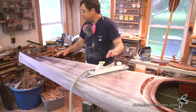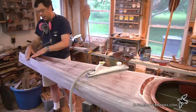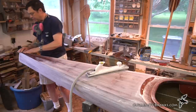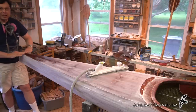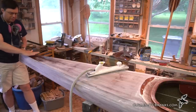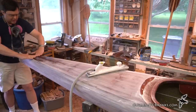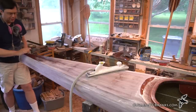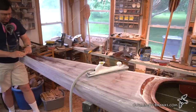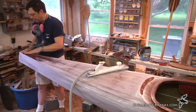As I get into the back deck here there's a similar thing going on. The angle from the top to the side is more pronounced — easier to not mess that up. But I also have a spot where the flat curve of the back deck transitions into a little V, and I like that detail. So I want to hold the block flush against the surface I'm working on. It's a little tricky as it twists approaching the end, so I may switch to a smaller sanding block — this is really more sculpting than fairing, and I need to be cognizant of that.